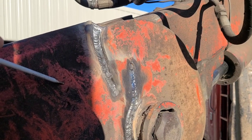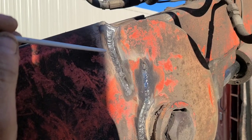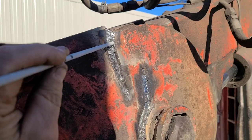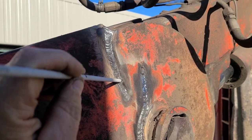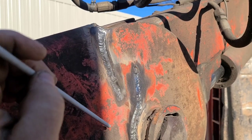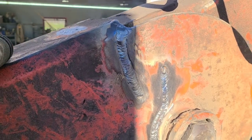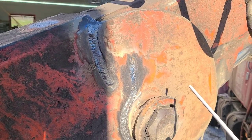I'm going to get some other rods, turn my machine up, and get back on this. Just ran that third pass using the 1/8" rod — everything's good. On this one I started right there and ran a bit of a stringer to about here and then started weaving. The reason I didn't start down here and go straight is there was a low place there, and the sooner I start getting it even the better — I'm not going to wait to the next pass. I've filled it in a little and weaved it up through there to get it more even, then ran one more up from the bottom. That makes this section have four passes while everything else has three — doesn't matter.